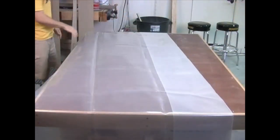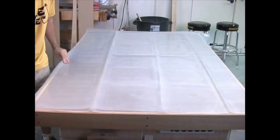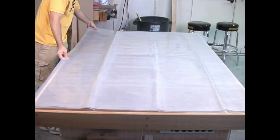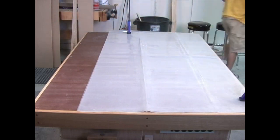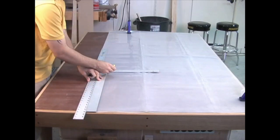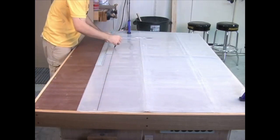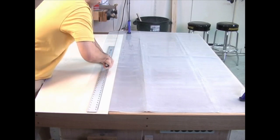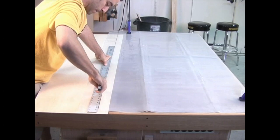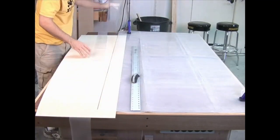I start the process by completely unfolding the sheet of poly on my assembly table. I then fold the sheet in half — it's important to make sure that the sides line up perfectly. I need a little extra room to work so I move the whole sheet back a bit, but I need to use quick clamps to stop the poly from falling off the table. Now I need to draw a line four inches from the edge. The easiest way to do this is to use two metal rules — each one is two inches wide so there's no measuring involved. Using a line and a steel rule as guides, I cut through both layers of poly using a utility knife, using a piece of scrap ply as a backer so I don't cut into my tabletop. When it's all said and done, you should be left with a very long four inch strip.